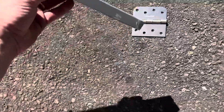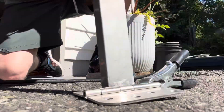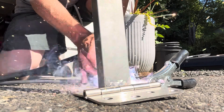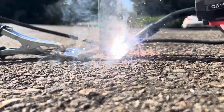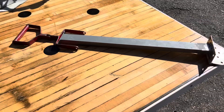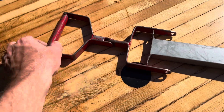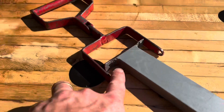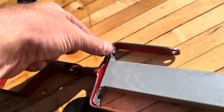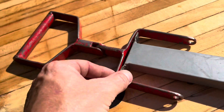What I'm going to do is just take this piece from my handle and weld it on like that, and then weld this piece to the cart. That side's going to go to the cart. This piece has got a nice hinge on it right there, and this part has some holes in it, so I'm going to take advantage of those. I'll cut these legs off here to make it match up, drill a couple holes through this that match up with these holes, and then just put some bolts through there — and I'll have my handle.